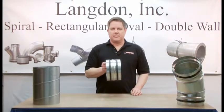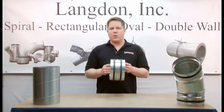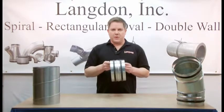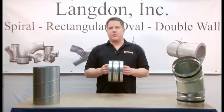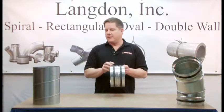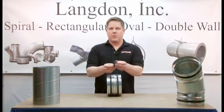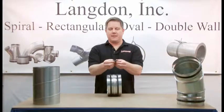This is SureSeal gasket — a patented self-sealing gasket system for spiral air duct work. When installed, it provides a sealed transverse joint. SureSeal gasket is an EPDM rubber gasket with a U-shaped profile with two outwardly sealing flanges.